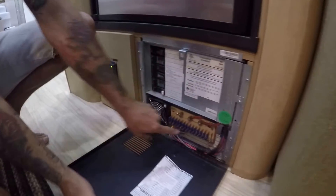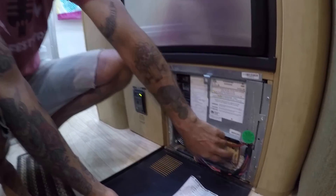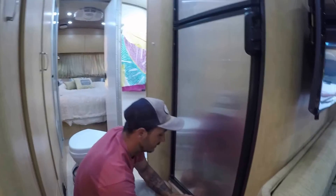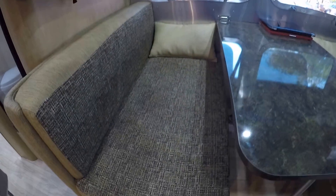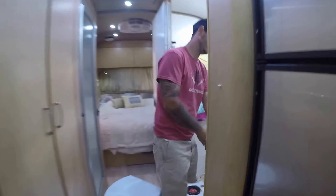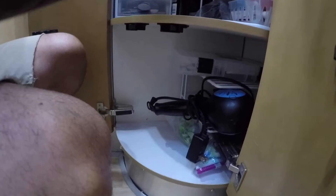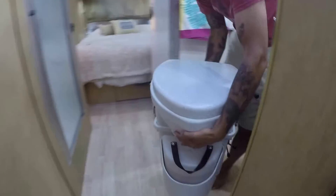Also run your 12-volt power supply in here as well. I ran my 12-volt power off the breaker box located under the refrigerator. When an Airstream comes, it has a bunch of extra unused fuses, so I just ran a hot wire and a ground wire out of the breaker box and fished it back under the refrigerator. You can get to it by taking the seat off, going to where the hot water heater is, and using something like a clothes hanger. There's a panel under the sink — take it off and you can see behind the refrigerator; it's just four screws.